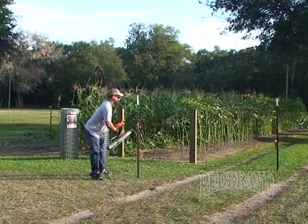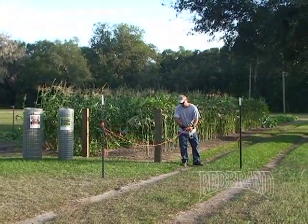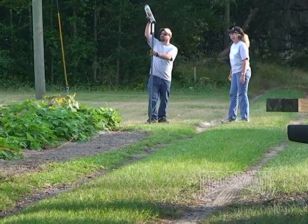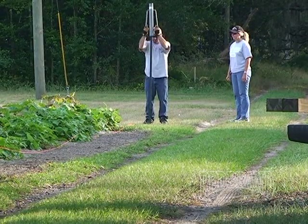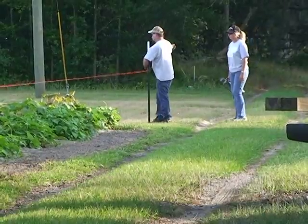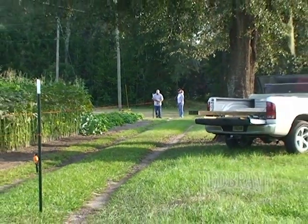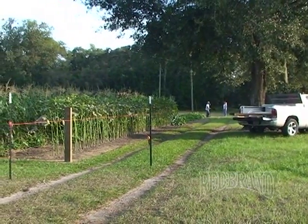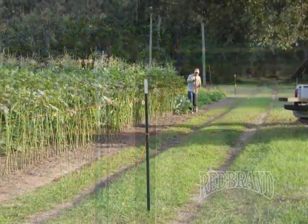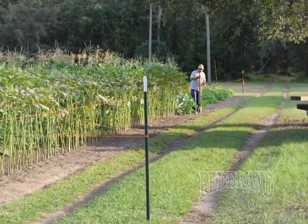Ken's going to walk this side string to the other end of the fence project. On the other end, just get an idea of where you want your fence to go. After driving this post, you can pull your string tight and bend it one way or the other just a little bit to fine tune where your fence is going to be installed. As you can see here, the side string is laying against our four by six. Here we're installing a center post. Because our fence line is so long on this side, we wanted to add rigidity to the fence, so we installed another four by six at the midway point.